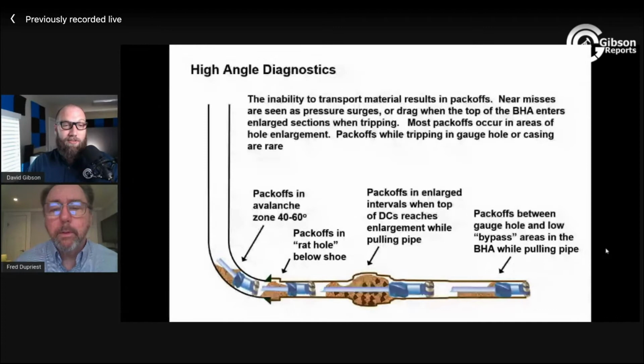I should have mentioned earlier that the cutting falls and hits bottom. We're talking about 10 feet. So if you were to stir this bed, you can do that. Stir is the wrong word. If you have a fat thing that you pull through the bed and the velocity around that fat thing goes up, your equilibrium bed height goes to zero, meaning you mobilize 100% of the cross-sectional area of the bed. Well, good. But it's going to fall out in 10 feet, possibly. Depends on your flow rate and some other factors. Maybe it goes 15 feet. But what you're doing with those devices is only affecting a small part of a 10,000 foot lateral.